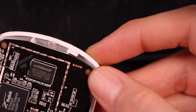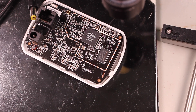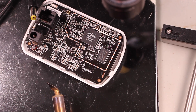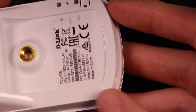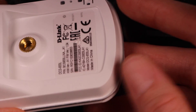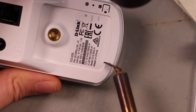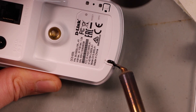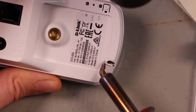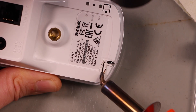It seems like I could just go in with the hot knife right here, or even possibly a drill press. Phil in chat points out that the drill press leaves a lot of plastic chips, which is definitely annoying. The hot knife avoids that. And the Dremel - I feel like the Dremel is kind of the worst of both worlds for this, because you'll end up melting the plastic, getting dust and chips everywhere, and you'll probably end up breaking a few cutting blades.